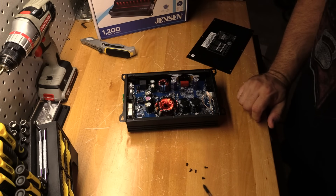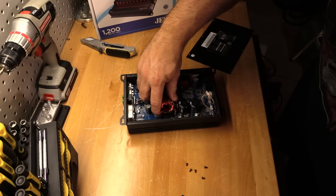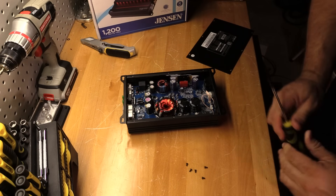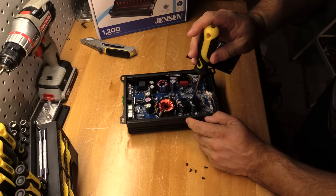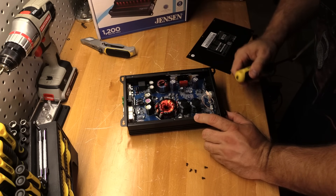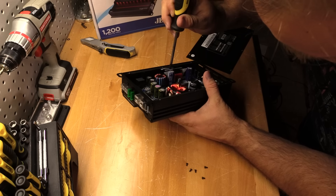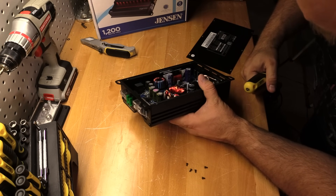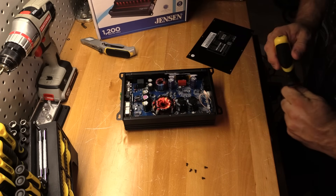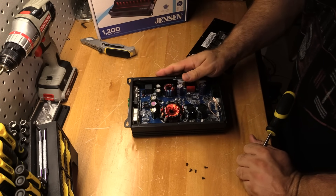Opening her up and we have pretty nice looking guts here for a sub $100 amplifier. Everything is rock solid in there — that is not moving, everything looks seated down really well. Build quality seems pretty good. These caps here are 80 volt, 2200 microfarad, 105 degrees. These are 25 volt, 3300 microfarad, 105 degrees — same thing over here. These smaller output filtering caps are 1000 microfarad and 80 volts as well. All of them are Chang X brand but ought to be decent. The MOSFETs are very, very nicely well constructed in here. Good job by Jensen, AKA Dual.